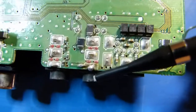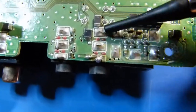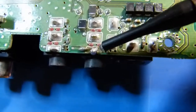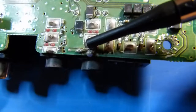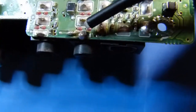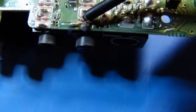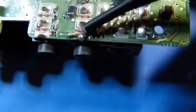Taking a closer look at the board where the external speaker jack is mounted, you can see the three leads coming through the board. The first two are soldered to pads properly, but this last one — there doesn't seem to be a pad on the board. It's hard to tell if there ever was a pad here. What's going on is there's just a blob of solder on the pin and a short piece of wire, or a component lead, soldered between the speaker jack terminal and a via on the circuit board. I'm not sure if this was done at the factory or if a previous owner tried to make a repair. The little piece of wire isn't really properly soldered to the speaker jack — the solder didn't wet to the wire very well, and what little bit did wet is now cracked and the connection is intermittent.